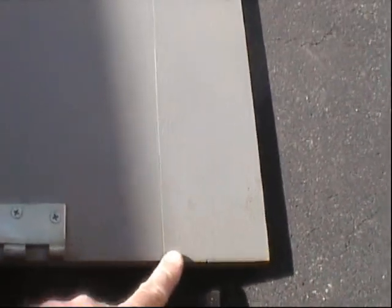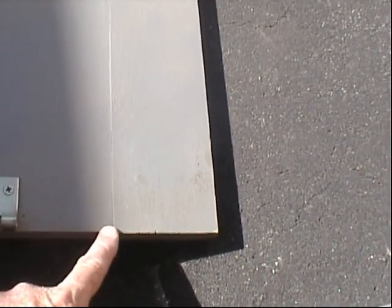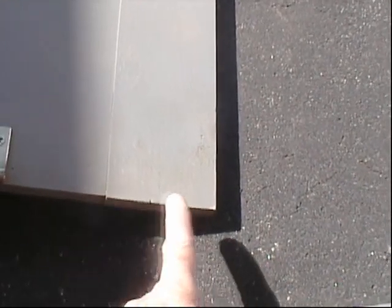This is going to be resting on dirt, so what you can do — they have that new PVC product for trim — this here was sort of like a sacrificial board, but with that PVC, which is expensive, you could only use the bottom portion. You could connect that with dowels to the bottom, and it would be resting on the soil and it would never rot — it would outlast the rest of the cold frame. You just put hinges in all four corners and it comes apart really easy.